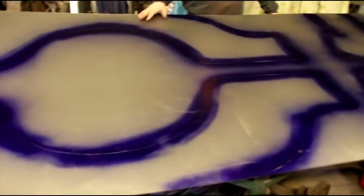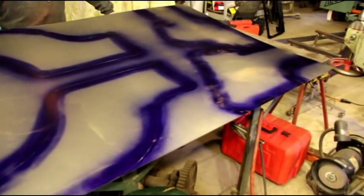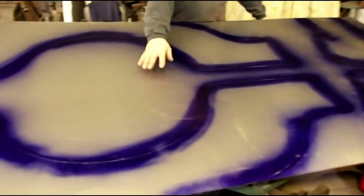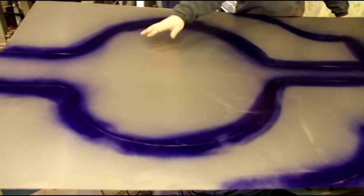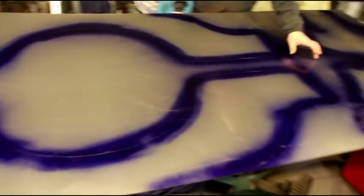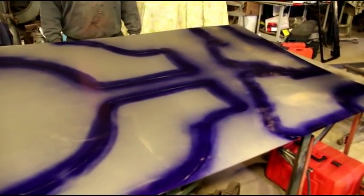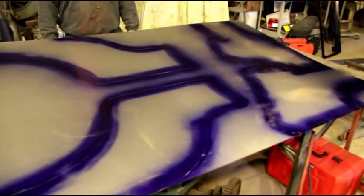I just want to show you how much you can get out of a sheet. You can get your four panels — both front quarters and both rear quarters out of a sheet. And out of this center section where it's all rounded in here because of the wheelhouses, you can get both taillight panels out of that. And out of this section right in here, we can get the rear cross valance there — it goes along the back of the Jeep.